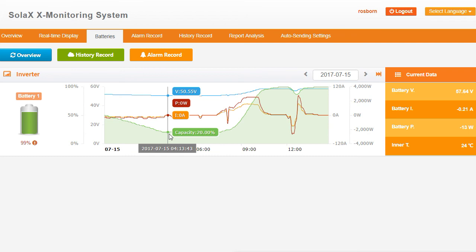There are a number of days when the battery isn't recharged and it can possibly get to a depth of discharge where it actually goes into safety mode, and you need to get support to get it reconnected and functioning again. So that's why it stops at 20%.